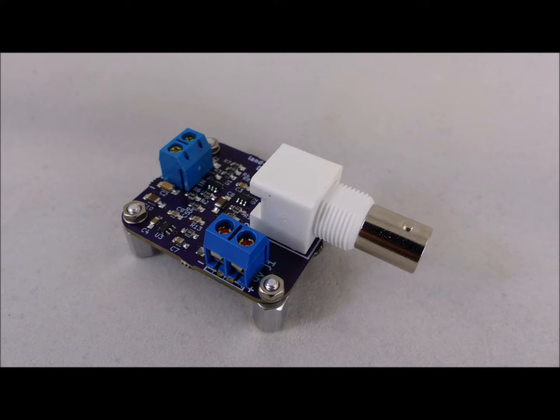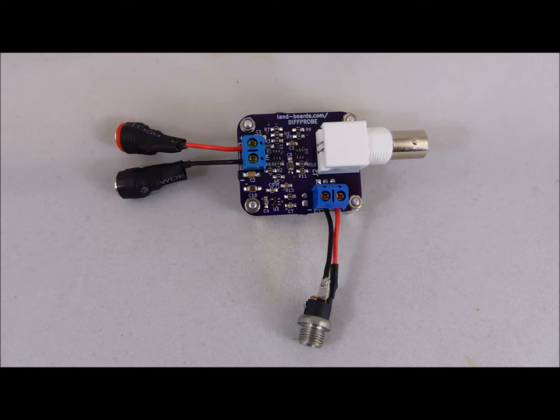We went ahead and set the board on 4-40 size standoffs to keep the pins on the bottom, the LED and the switch, protected. We used the same banana cables coming in that we used in the other card, as well as the 2.5mm power connector, which we connected up to a 9-volt wall wart again, the same setup as before.